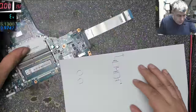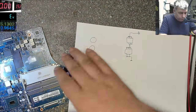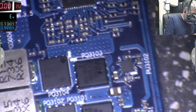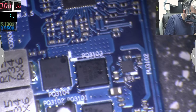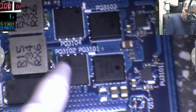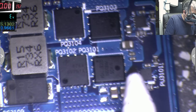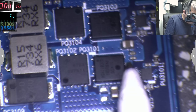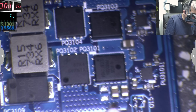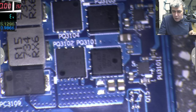We have these those capacitors. Yeah, let's just take the schematics out from the motherboard. So this is ground. Yeah, three pins, four pins together here, you can see, four pins together, here, four pins together, connect straight with the three pins from this chip, and these four pins together, which is plus, I told you, has a capacitor connected with ground, because these three pins are ground, this capacitor are ground, so this is a ground area, okay?